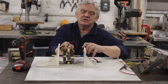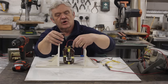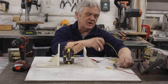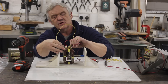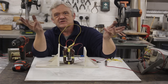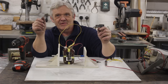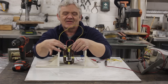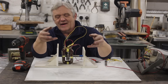The way you connect them up is you clip onto one side of the coil on the input side, and clip onto the other side of the coil on the input side — input and input — and then you bridge across the two outputs. It's dead easy to tell if you've got it right or wrong: if you don't do the cross connection and you spin it, you'll get nothing out. If you do it in the right connection and you spin it, you'll get something out. So it's only four connections — attach them, spin it, and when you get something out you know you've got it connected the right way.